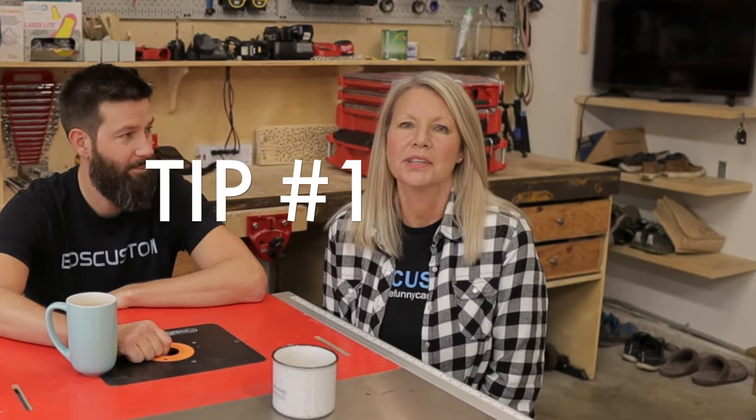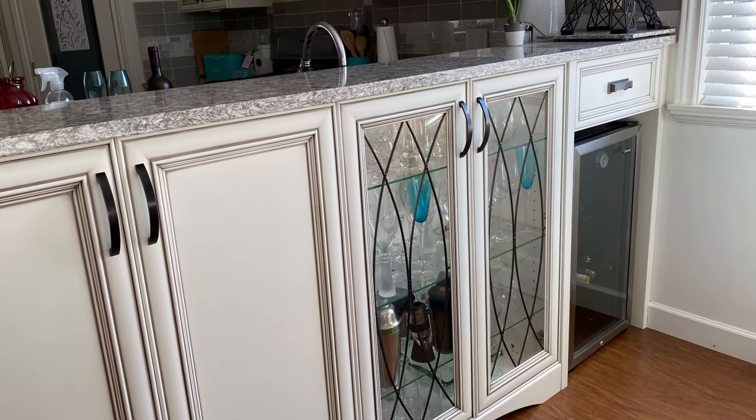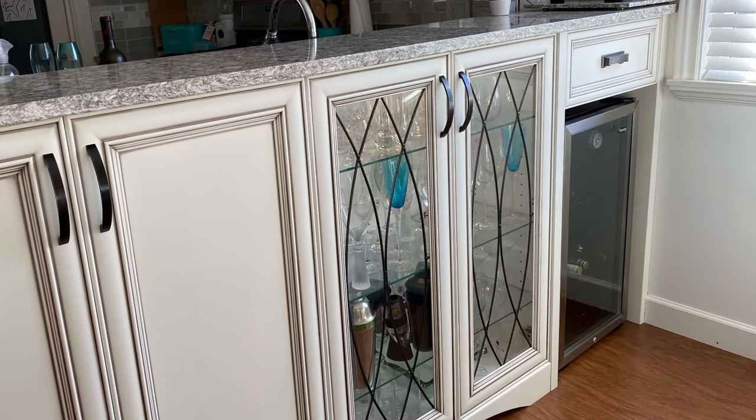Number one: when you're in the design stage, you should just blank off the corner cabinet. You don't lose as much space as you might think, and you gain space on either side. You can have larger drawers or cabinet space there, and if you happen to have a peninsula, you can utilize that space on the other side with some drawers facing on the back.